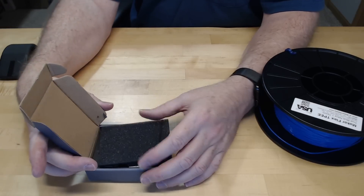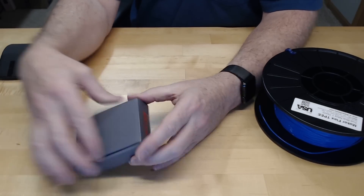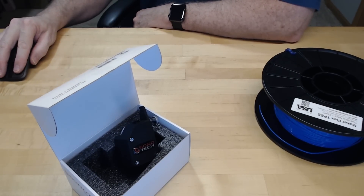So the plan is: I've already tried the first step which didn't work out. Next I'm going to try the Bondtech extruder to keep it a Bowden system, since it's the simplest upgrade. We'll pop it in, test it out, and I think it's going to work. After that I'll probably move to the next step - put the Flexion on and convert to direct drive. I just thought it would be interesting to show all the different types of extruders. There are other options out there, but the Bondtech, the Flexion, and the printable Thingiverse version are the big ones everybody talks about.